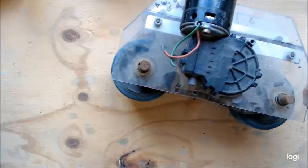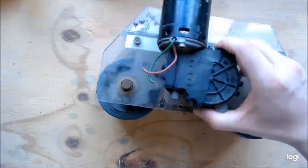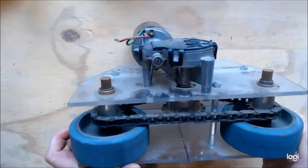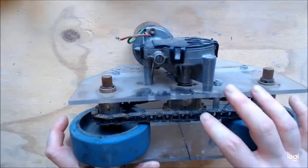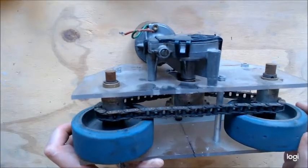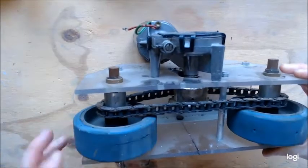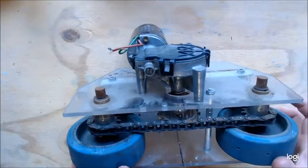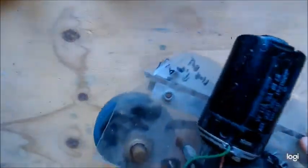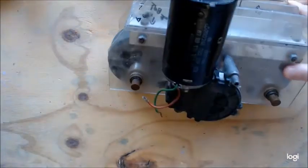Here I have a motor and worm gear assembly. This in turn drives a main gear, and that drives two subsequent gears connected to wheels. By adjusting this gear to make it smaller or larger, it can be made faster or slower. I never used this because subsequent motors came out — I made this around 2000, so it's now 20 years old. It does have two-wheel drive, so in total you'd have four-wheel drive. The downside is when you try to turn on itself, you scuff the wheels — never a good drive system, which I know now.